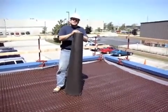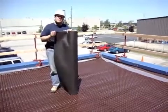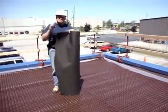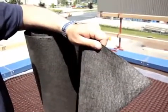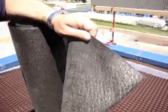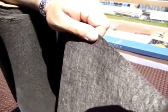The next stage is to put down a geosynthetic fabric. The reason we're putting down the geosynthetic fabric is because we want to maintain the cups free from the growing medium so that they can fill up with water without being filled with growing medium. We recommend using a geosynthetic with a minimum of four ounces per square yard to ensure proper drainage so that soil particles from the growing medium do not clog up the fabric.